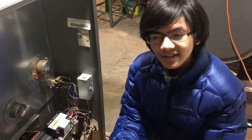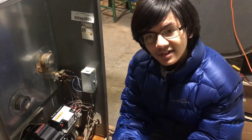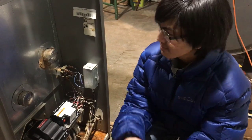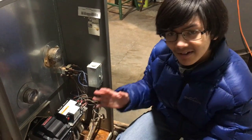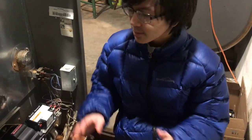So the basics of fire is that it needs air, fuel, and a source of ignition. In this case, air is pretty irrelevant because there's air all around us. So that means first we have to check if we have fuel, which is the oil — and we actually have a ton of fuel. So next we have to check if the fuel is actually getting to the burner.